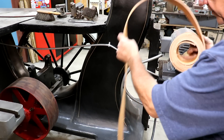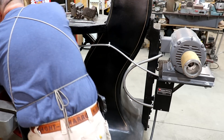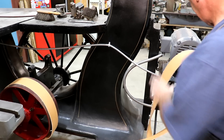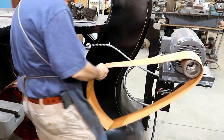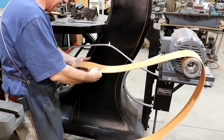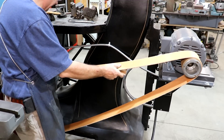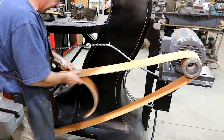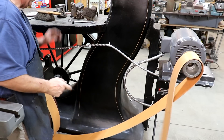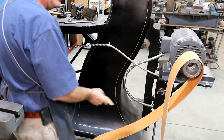I've got my belt that we're going to use here — this is just some flat belt material. In this case I ordered it from McMaster-Carr. What we'll do is we're just going to get this cut to the right length and spliced together for this machine. I'm just going to kind of loop everything around and get a rough idea on where I need to cut this belt. I've already cut one side of the belt square, so I'm just going to kind of pull this up tight — it's not super tight, but this will give me an idea of where I need to cut my belt. I'm going to mark that and cut it about an inch shorter than that, which will give me some stretch, and I have some adjustment in the motor base to take that up.